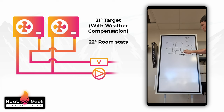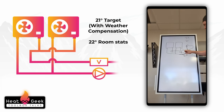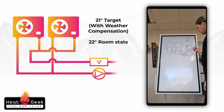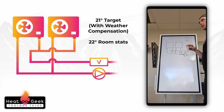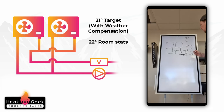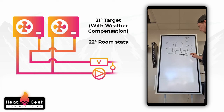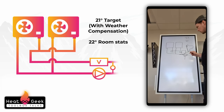Volumizers — if you've got two heat pumps you've probably got a hefty system, so volume should be there, but a volumizer is worth considering. You've still got to put all emitters on bypass because if everything shuts down during defrost, you need flow — unless you've got a towel rail or something always open. The problem nobody has answered yet: this is a modulating pump — what pressure do you set it to in relation to that? There isn't a clear way to do that, and how does this really perform when all zones close?